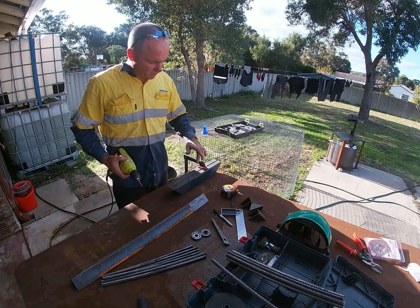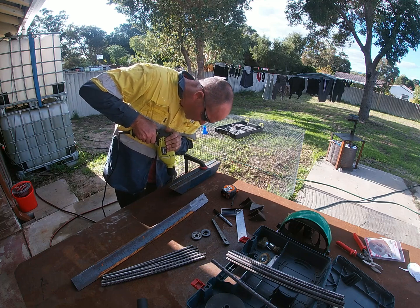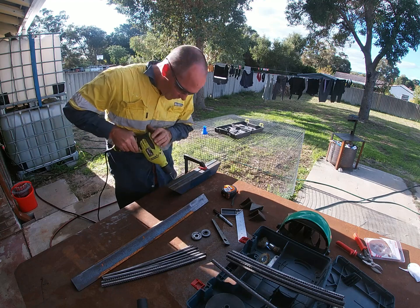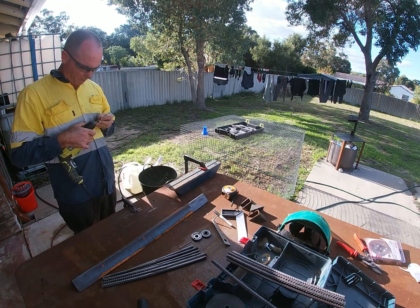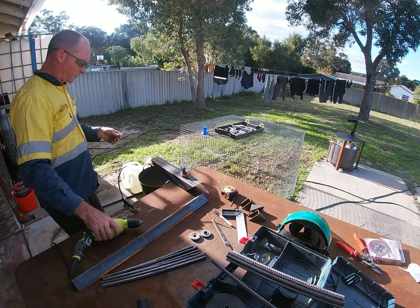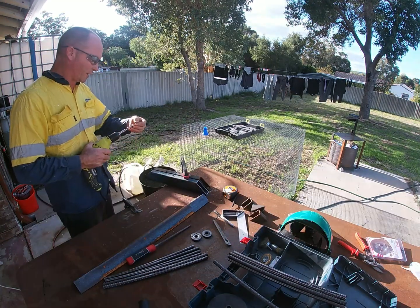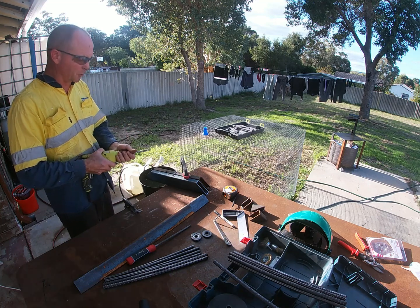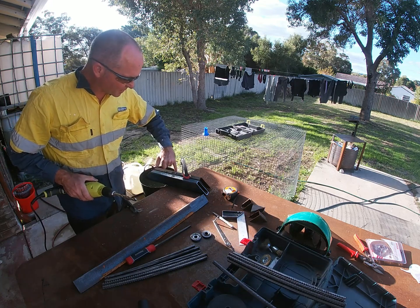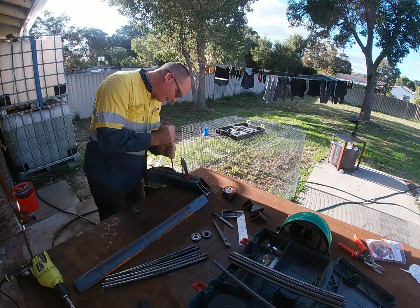I've just got to drill holes for the screws that will screw into the bottom underside of the tabletop. Doing a 3mm first. I'll take it out of hammer. I'll go up to 4.5mm, cooling as I go. Keep going up through the sizes. Might go through at 6mm, that'll mean any screw that I choose to use will fit through that. Finally, I'll just go through there with the 12mm drill bit. But I don't like what that's doing to the drill bit. This one was a bit odd because it had half a drill hole from the underside. So I'll just finish this one by hand.